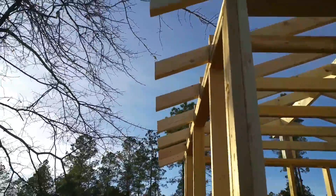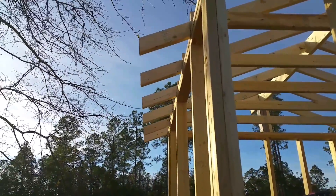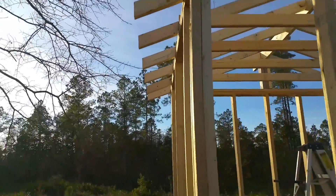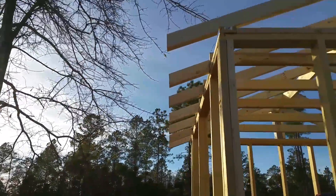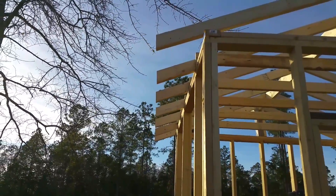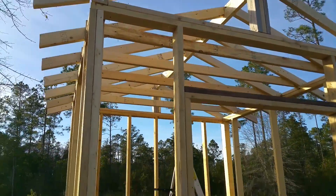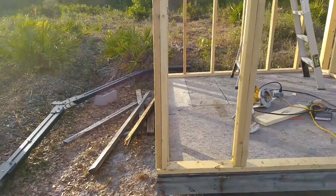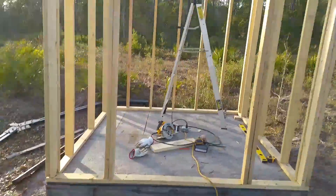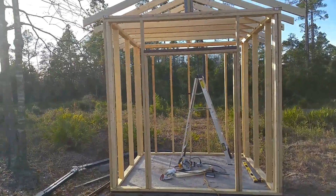The actual ends of the common rafters are a foot overhang. Some people go back and cut them after, but I was pretty confident in the measurements we had here, so we don't have to go and chalk line and then cut them — we have exactly a foot overhang on each one. I'll keep you posted as we continue to enclose the shed, and then we'll finally install a door on the front to complete our project.